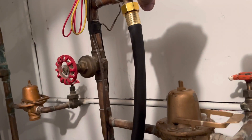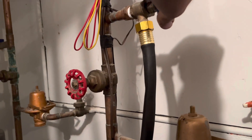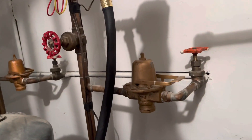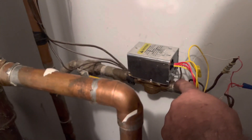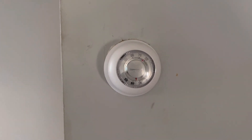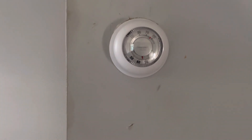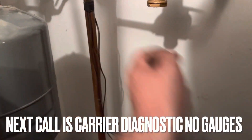You got air? Yeah, we got some air. That's when water came through — keep watching it until you don't see air. It jumps like that — it's air. I'm going to go to the thermostat. You're going to look at this arm — you're going to see it actuate, meaning it's going to call for the downstairs zone. You see it? Set for 68. So these have been changed, we just purged them, and he's all set.